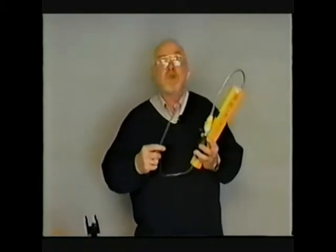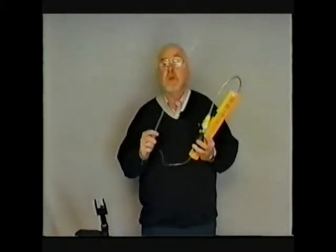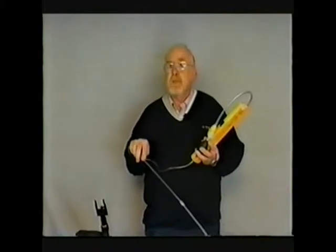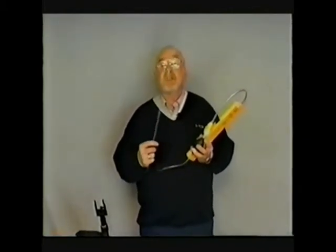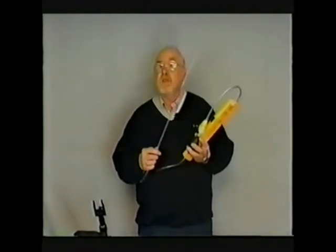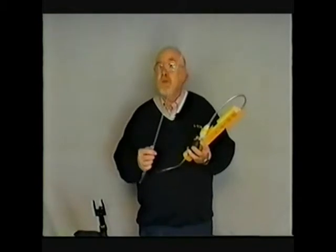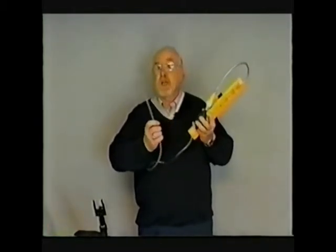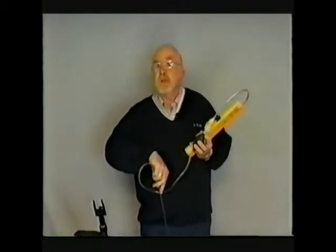Bring the probe into the hole with you, place the coupler over the sensor, and now sniff test all four corners high for any gases that might be lighter than air, and all four corners low for any gases that might be heavier than air. For example, methane is a gas that is lighter than air and could get trapped in pockets, especially when it's very muggy or humid, or if the holes are located near steam lines. Test all four corners — six sniffs per corner — for gases lighter than air. All four corners low for gases heavier than air, like propane, which is heavier than air.